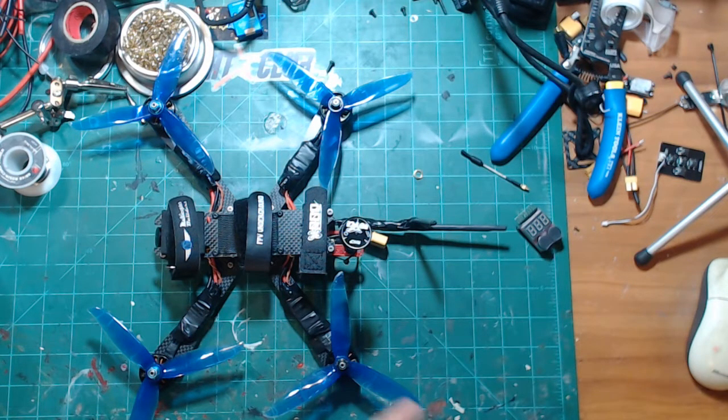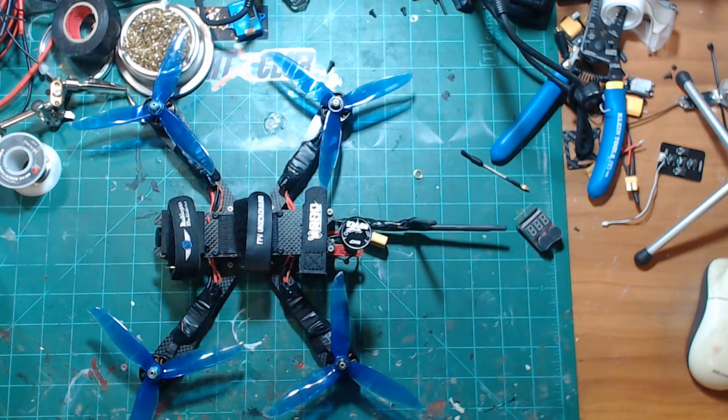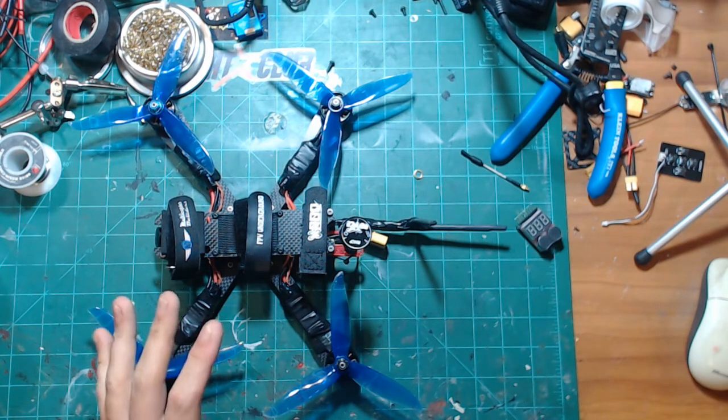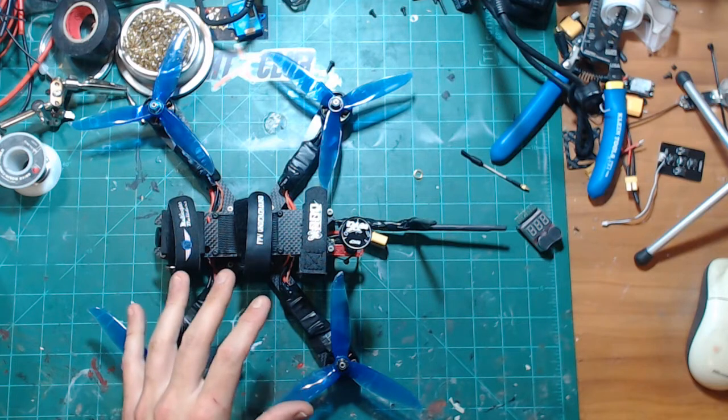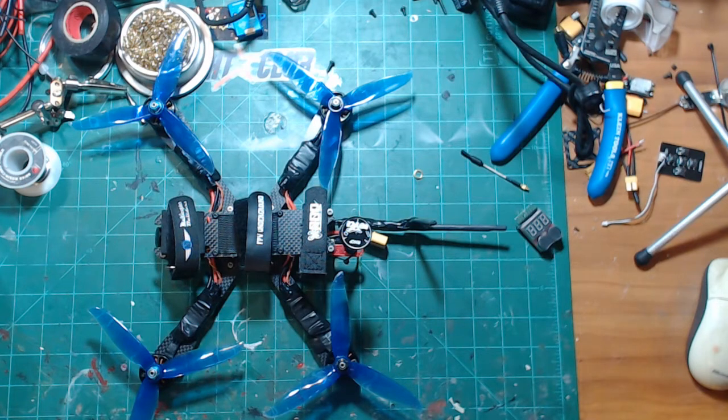It's over muddy cornfields and stuff like that, so the RF is just getting soaked up by all that. But as soon as I get out to about 3/4 of a mile and I start losing video because I can't penetrate through that anymore and I gain altitude, then my 150 hertz will come back. But if I plug a battery into it and fire it up at 2 watts, I don't know. I've never actually fired it up at 2 watts and seen if I could keep 150 hertz through there.